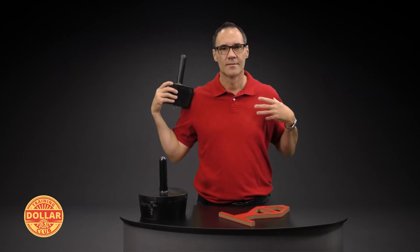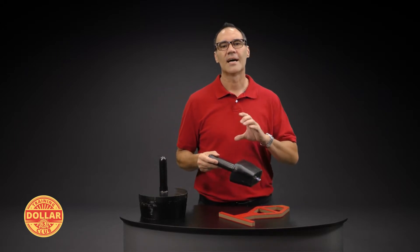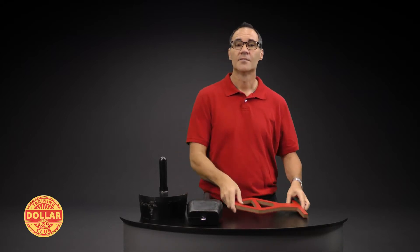What we're going to do is use this to test whether or not the child's body will pass through a bounded opening. A bounded opening is that fully connected opening — basically a hole that's been punched into something. If we look at our fish probe, for example, you have a bounded opening connected on all sides. So if we have a square, all four sides are connected; a triangle, all three sides; a rectangle, parallelogram — all four sides connected. If it is a circle, it is a continuous circle.